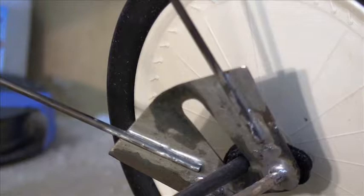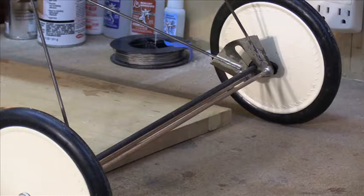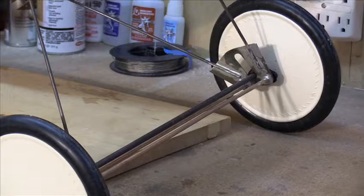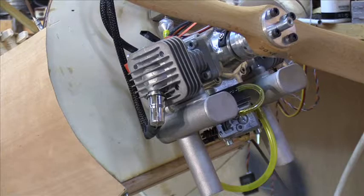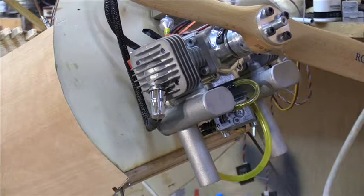The axles are quarter-inch music wire. You can also see two spreader rods — these are actually made out of brake line for hydraulic brakes on a car, available at an automotive shop. They're 3/16 of an inch and hollow, and they solder very well. It's a very good, inexpensive way to add the shock-absorbing bungee to your World War One airplane.